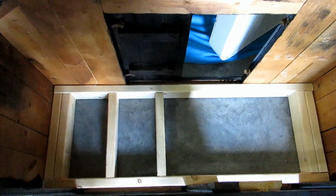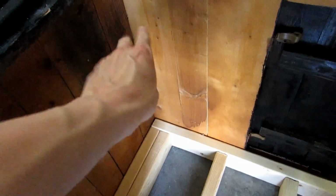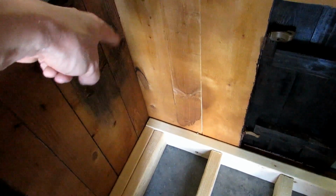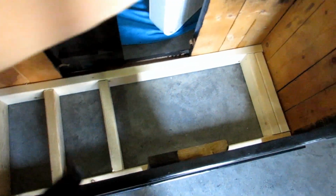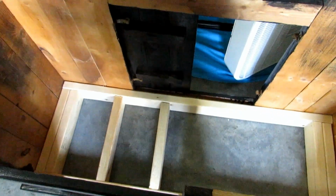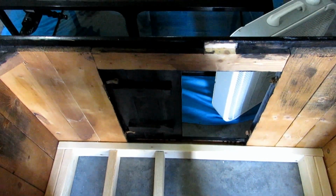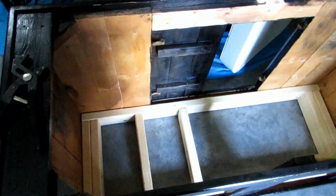But you could see the double braces that I put on the sides. And I'm actually going to do two 2x4s coming up in an L shape here in all four corners. I'm probably going to have one or two more come up on each side, and then probably multiple 2x4s come up on the front, and then probably a couple more, or excuse me, this is the back, probably four in the back here and probably two up front. So I'm probably going to have to go get more 2x4s, but I don't think this thing was adequate the way that it was set up.